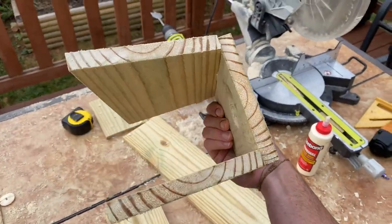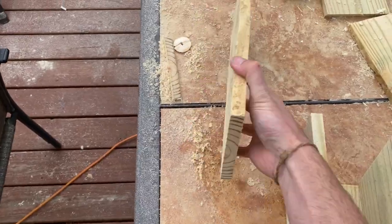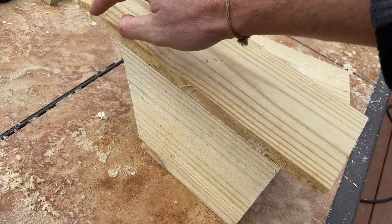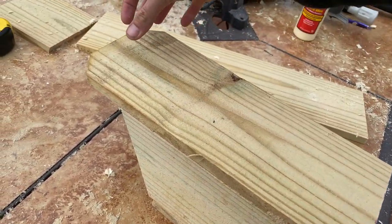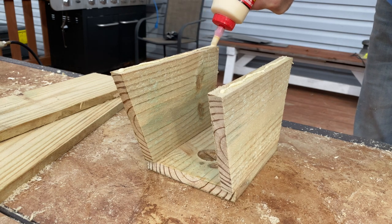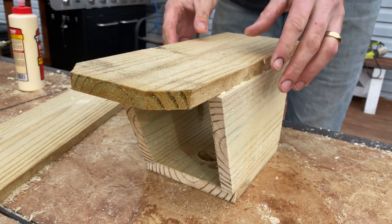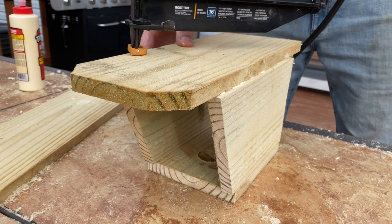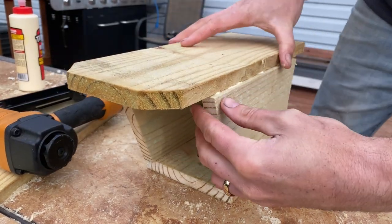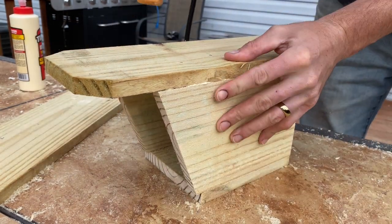Here's the beginning of the bird box with the front and sides attached. Now we're going to attach the back — the first piece we cut at 15 inches. The easiest way is to lay the birdhouse face down, put the back on it, and nail in from the back side. You can adjust it up or down as you like, but keep in mind a roof and bottom will be attached later, so leave a little room for those. Put a little wood glue on, get the piece centered, nail one side in, then push the other side in to square it up and wipe off any excess glue.